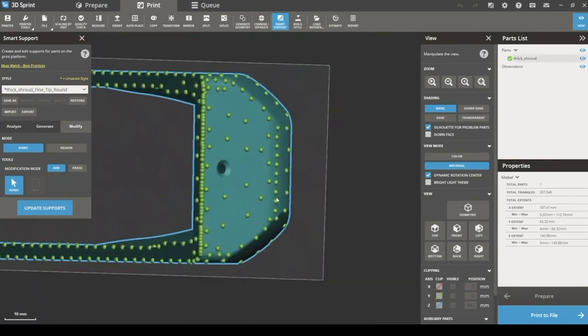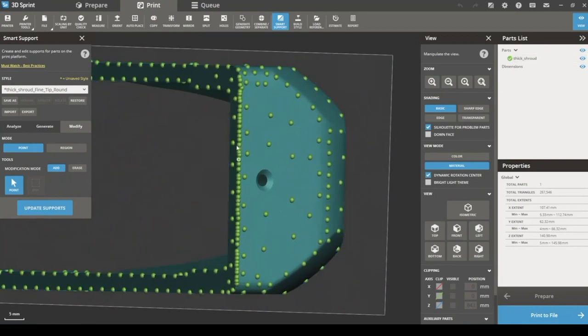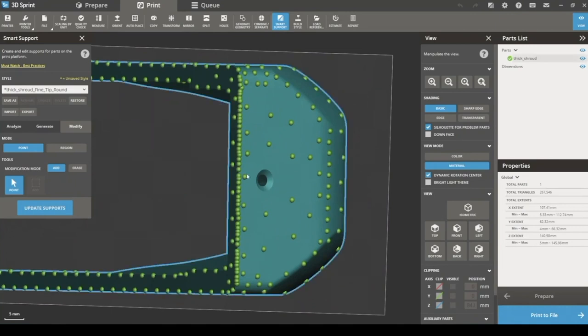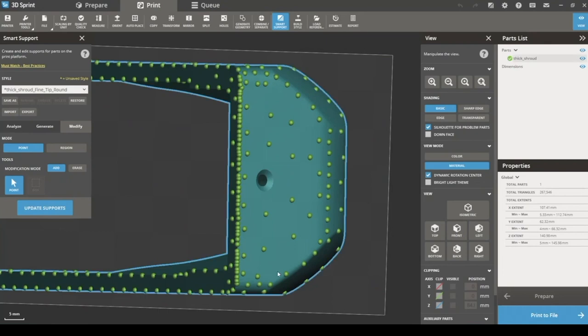And let's bring this up where you can see what I've done here. So what I've done is I evened out the supports along the sharp edge. I added some supports to give me sort of a tripod on the left and right sides of that edge to prevent my part from moving back and forth through the hydrostatic forces. I added some supports along the edge here to help maintain that edge shape and give me balance as I build the larger part above it. And a little more support here in the middle to also allow for that balance.